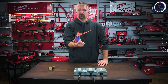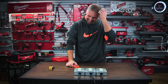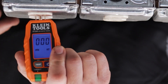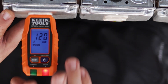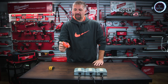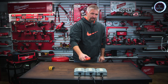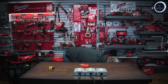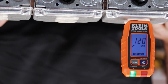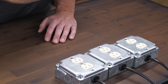The middle one has hot neutral reversed and it shows 120 volts. Now let's try a different outlet. This one is faulty too — I'll pull it out and read it: open ground, flashing fault. Now the last outlet — we plug it in and we have it correct. Green light, everything's looking good.